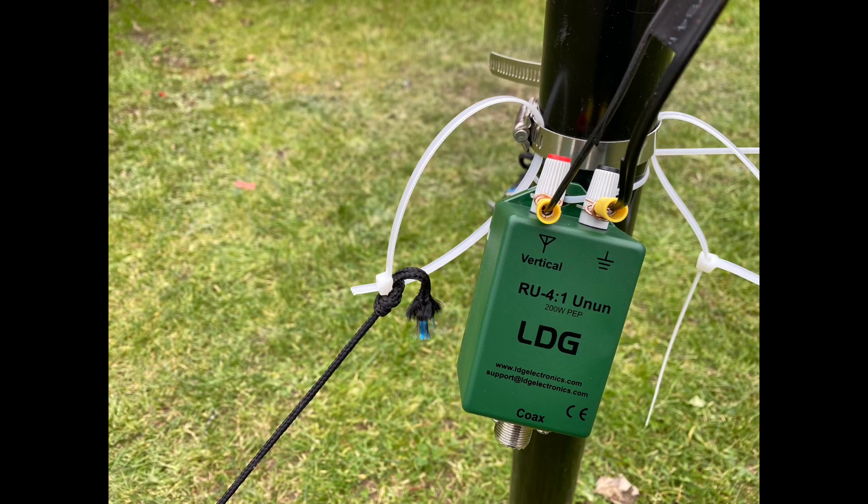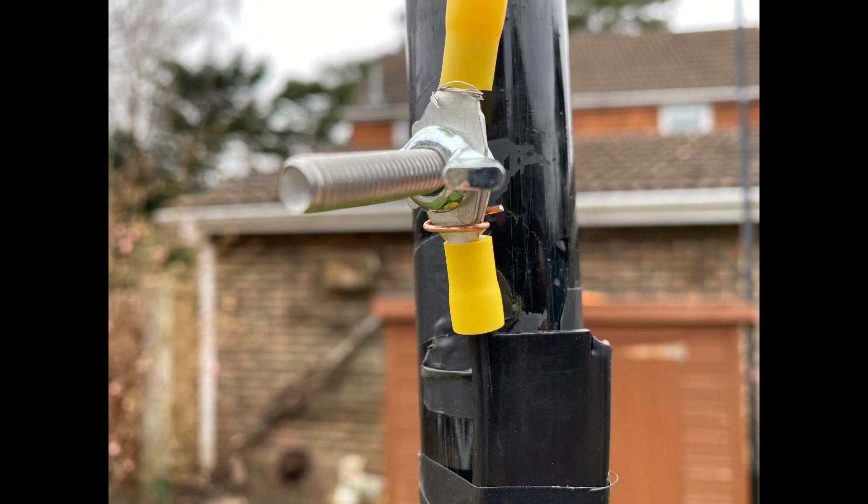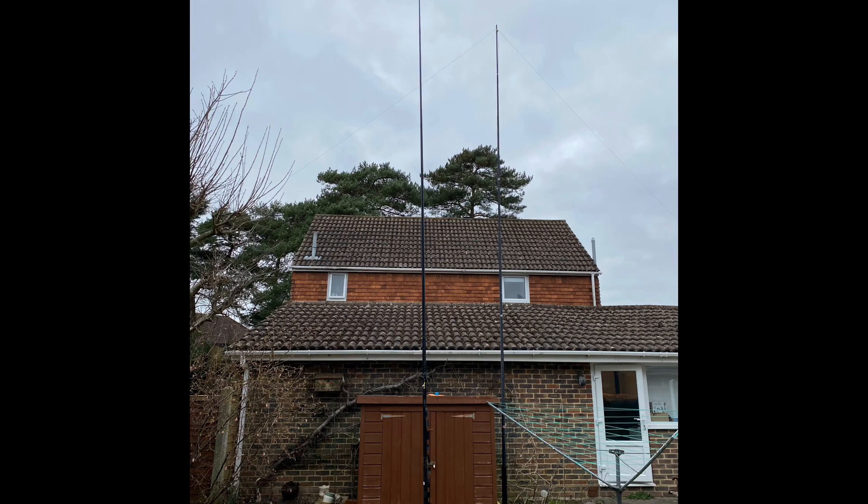That's the design that caught my eye. If you're going truly portable — say doing SOTA or just being lazy like me — you can take a really lightweight 7-metre fibreglass pole and this fits on quite nicely as a vertical. As you can see from the antenna I put up, it really was a lash-up effort. Here's the 4-to-1 unun towards the base of the antenna, with the ladder line attached — one to the hot side in red and the ground side in black. I even used a wingnut to attach the ladder line to the radiating wire instead of soldering. Ignore the 40-metre dipole in the background — yes, there probably was some interaction. You're in a small garden, you've just got to play with these things.